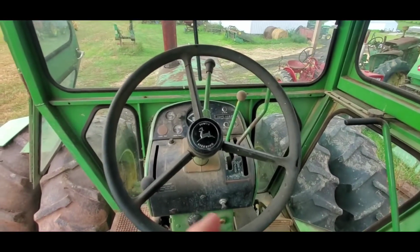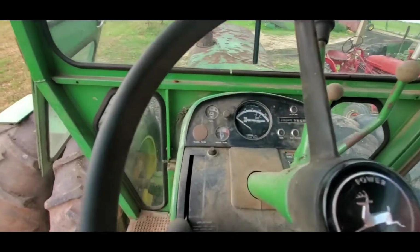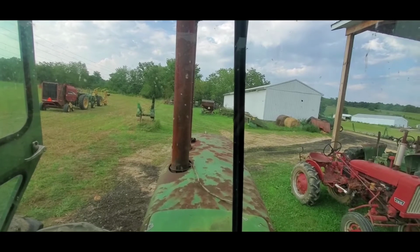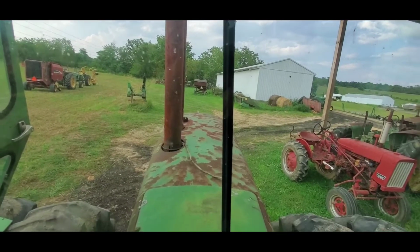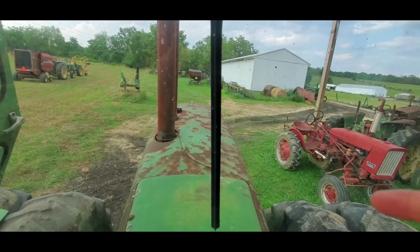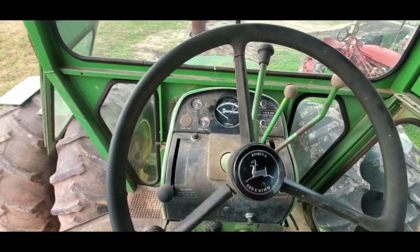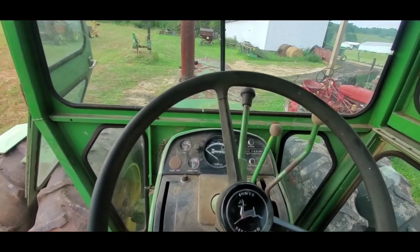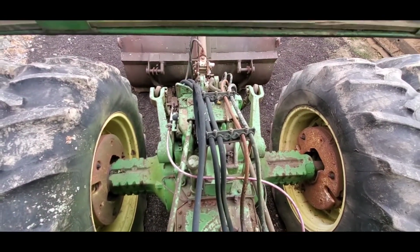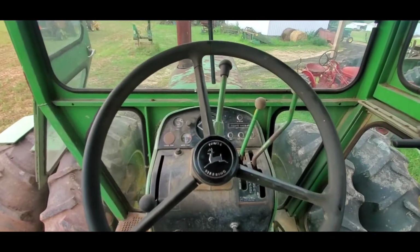But basically, in the knuckle, or the bending joint, directly under the seat here, these tractors only have 2 shafts. There's one coming from the clutch going back, and another one going from the transmission going forward. Obviously, the one from the transmission going forward powers your front axle, and the one coming from the clutch back controls your entire transmission, which is all there behind you on this one. So, like I said, that's another notable difference.